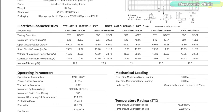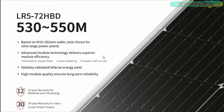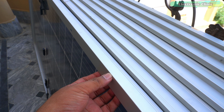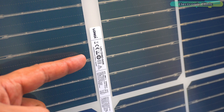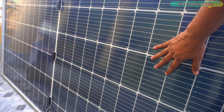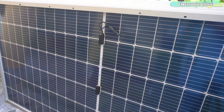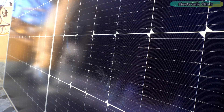Based on these technical specifications, I think the Longi solar panel is an efficient choice for both residential and commercial solar installations. For my 5 kW solar setup, I purchased 8 Longi solar panels — each costing around 25,000 rupees. These are the LR5-72HBD-545M model panels. This is the rear surface where you can clearly see the solar cells, which can capture reflected sunlight and diffuse light from nearby buildings or other surfaces. And this is the front surface to capture direct sunlight.